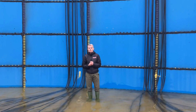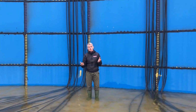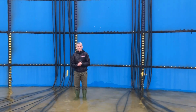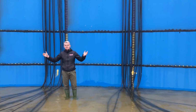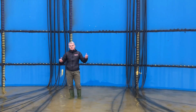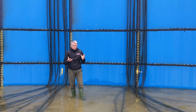Okay, so with these diffusers in non-separated, so normal slurry, working potentially at a diameter of 5 meters, and in separated slurry they would work at 7.5 meters. Obviously with separated slurry without the solids in, it's easier for the bubbles to move throughout the liquid.